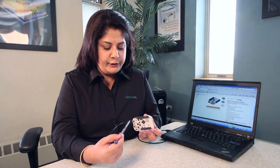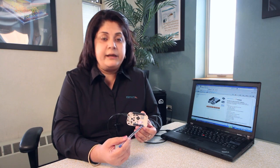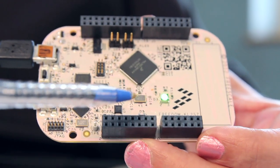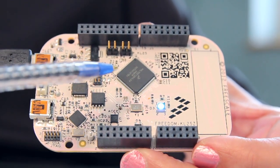There are many power supply options offered with this board. It can be powered via a USB connector or a coin cell, with the battery holder provided on the board. There are 5 and 12 volt inputs offered on the I/O headers, as well as a 3.3 volt input and output on these headers as well.